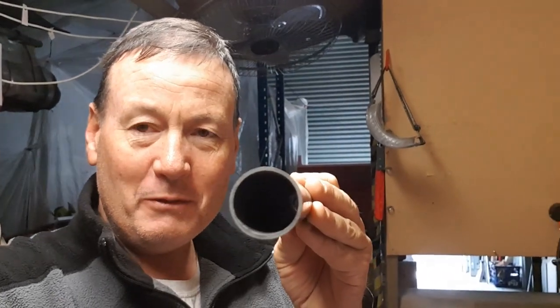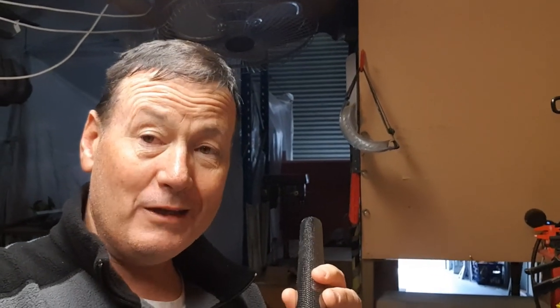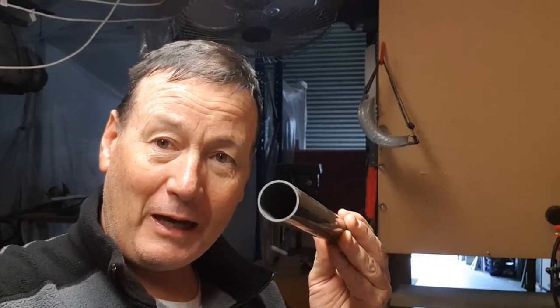And this tube is about four layers of 180 gram carbon, so it's a fairly substantial tube. I'm going to hole saw through the bulkheads at each side of the tank, and then I'll be able to pass a strap through that, either a stainless strap or a nylon strap or a webbing tie down or something like that, to get the basis of the holding mechanism.